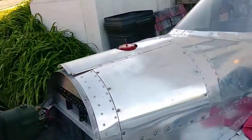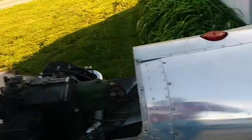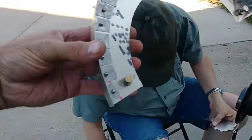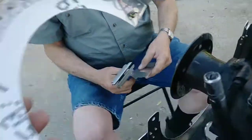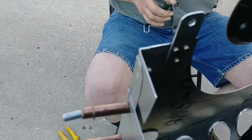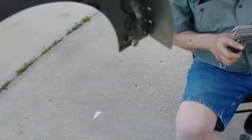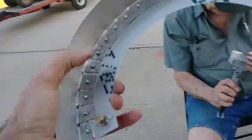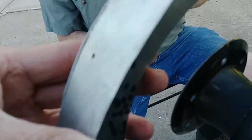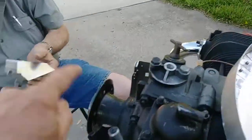Since I did this to my Ultra Cruiser, and actually the H5 too, I cut the top of this off and put that bracket in there — that's a 40-thousandths bracket — and then put rivet nut plates on there so you can take this top part off to get access.